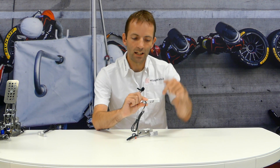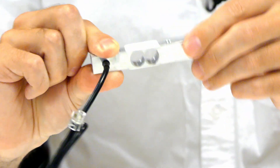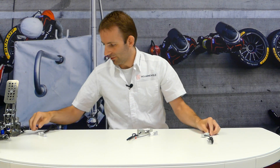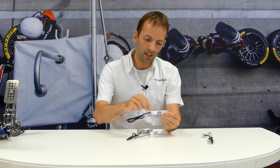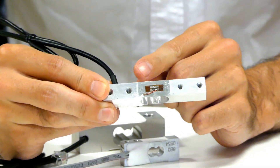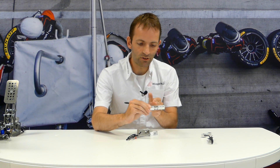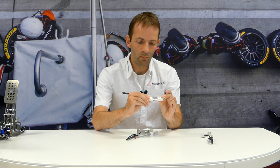But how do they work? Well, mechanically it's quite simple. You have to clamp one end firmly and then you put vertical load on the other end, and that is measured as a force. Now that's quite unintuitive and complicated, so I've demolished one. Here is the one kilo load cell, and if we remove this white protective cover you see a tiny strip that is glued into place. When we load the load cell you get a tiny little bit of bending and stretching going on in the material, and that changes the resistance of this little thin strain gauge — as they are called — which are glued on here. And through a circuit it changes the voltage that comes out of the sensor ever so slightly.